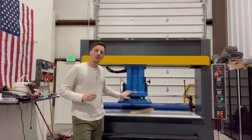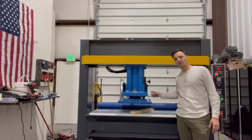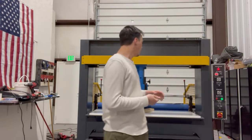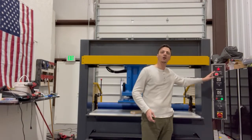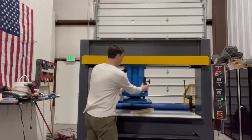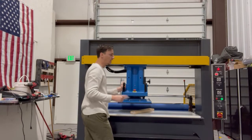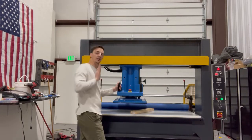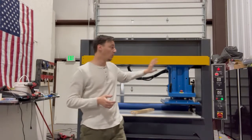If you need to make sure that the machine cuts deeper or shallower on the side, there's going to be a knob — you'll turn that dial to make the head go deeper or shallower depending on the cutting depth that you need. For the head traverse, for that sidestep movement, you can control how far that goes with this top dial here. That will determine how far out of the way it moves. So I'll turn it all the way down to just a hair — we'll move it over a little bit and it's going to go this way just a little bit. If I want it to go a lot further, I can turn it up, move over, and it's going to do a compression and then go that way.